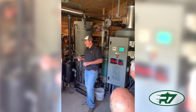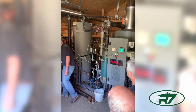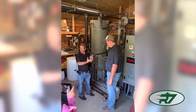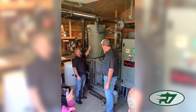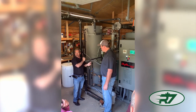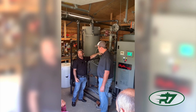190 Fahrenheit. So now the water in the tank is cold, or right now, temperature? It is at about 30 degrees Celsius. And you want to crank up the number. Yeah. So what I want to explain is that when we talk about the zero system, the water will probably be at room temperature. Presently, it is at 30 degrees Celsius, and it will go up to 90 degrees Celsius before the system will be functioning. The valve will control the period of time to make sure that the system will be at temperature.